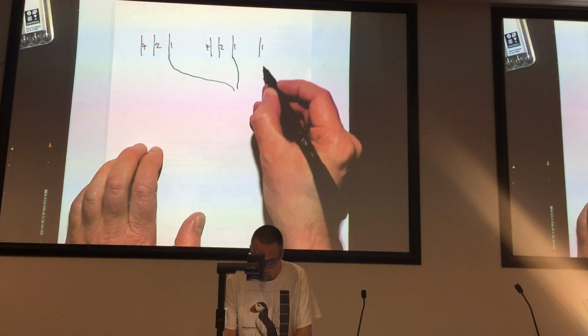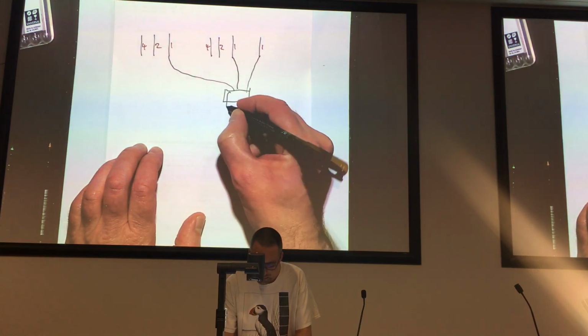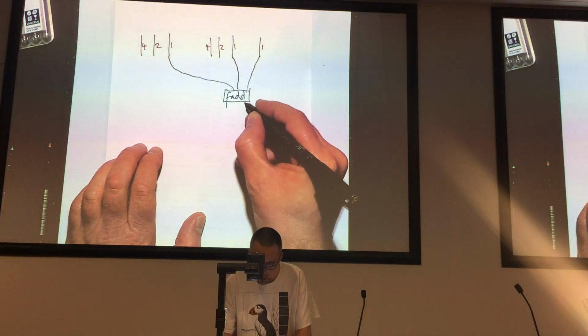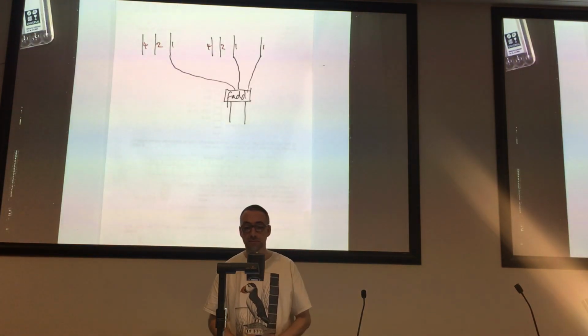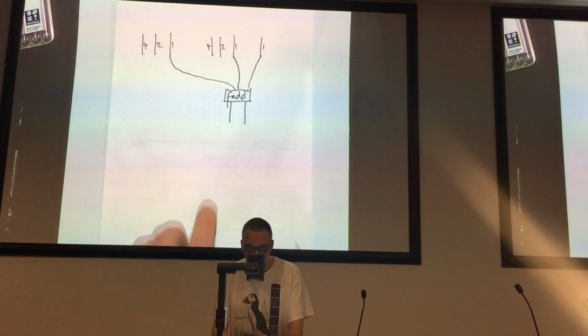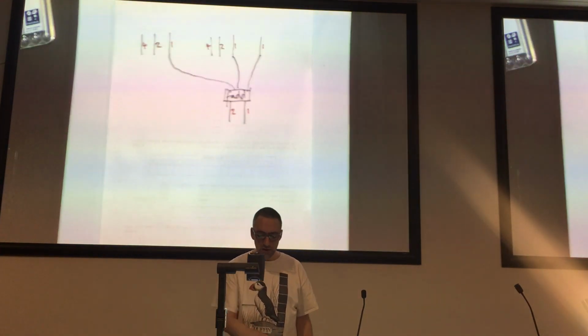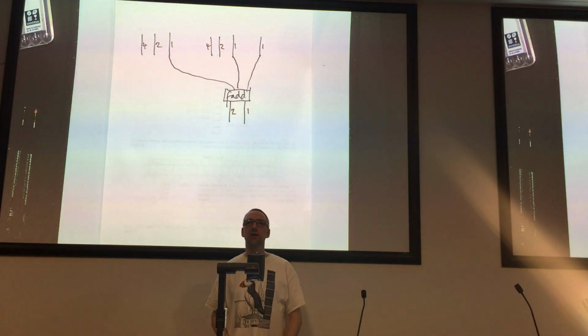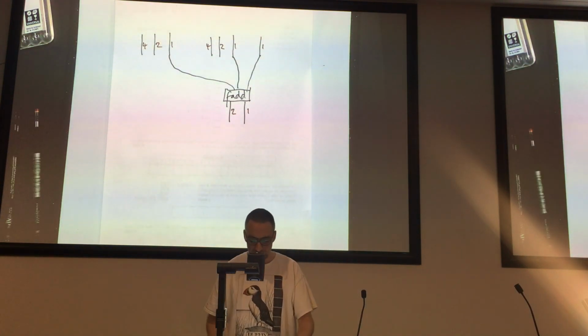This diagram will get messy, I'm afraid. Add them together with a full adder. What comes out in terms of place values? A 2 on the left and a 1 on the right. So now you can see, how many signals at place value 1 have we got left? 1. We've just got the 1.